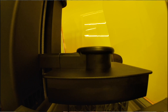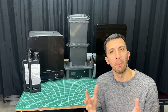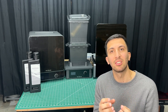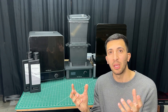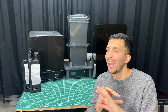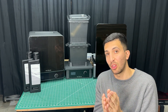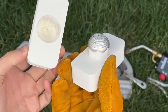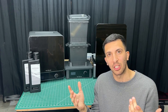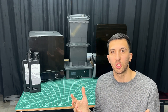Alternatively, we have resin printers. Resin printers print our second category of plastics — thermoset polymers. These usually don't melt; they undergo a chemical reaction when heat is applied that makes them solidify, and this reaction is not reversible. Think of epoxy as a great example: you have part A and part B, when you mix them they heat up a lot, causing a chemical change that sets the polymer permanently. You can't reheat epoxy and turn it back into two liquids. The benefit of thermoset plastics is that they usually have much higher melting temperatures and are more rigid. Their high heat deflection — meaning they can handle a lot of heat at higher pressures — is exactly what we need for plastic injection molding at home.